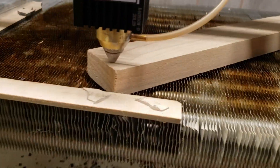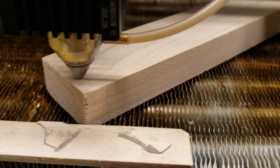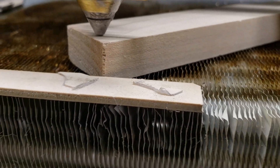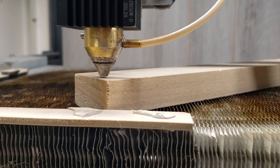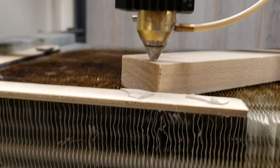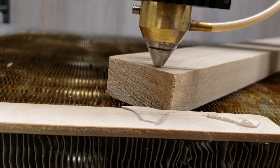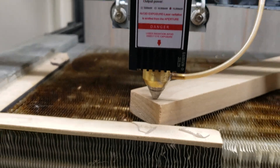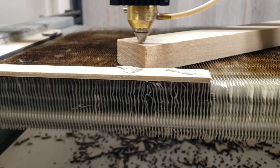I couldn't find any half inch wood within arm's reach, so I found this three quarter inch thick piece of poplar. It feels pretty hard — technically it is a hardwood, not gonna be the easiest thing to cut through — but I'm feeling crazy. I set it to 350 millimeters a minute, 20 passes. I've got it focused at about 25 millimeter focal length so that focal point is as deep as it can go, and the nozzle is like a millimeter off the edge of the wood. We'll see how deep that beam can pierce.